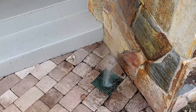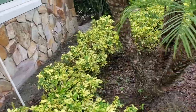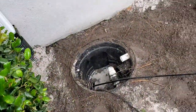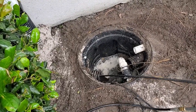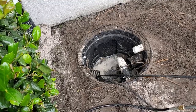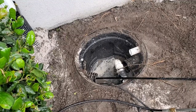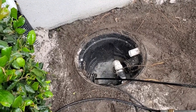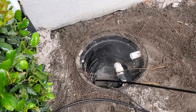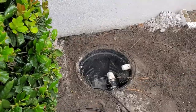The jetter is perfect for cleaning out sand and debris. It also cuts a few roots, but mostly it's for sand and debris. So if you let that jetter run as you pull it back, it pulls back all the debris — see all that debris, the sand and the mud? It just pulls it all back. Keep it running the whole time, pull it all the way back. See the spray coming out? So we know we're right there. What a great cleaning device.